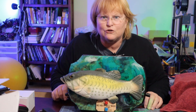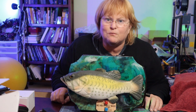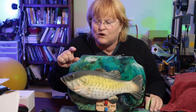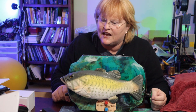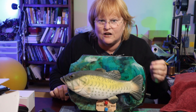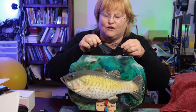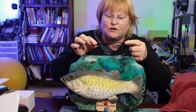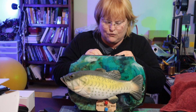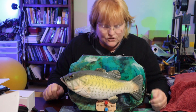I had a little trouble with power management. I tried to solder power to the pads on the back of the Raspberry Pi Zero W and ruined a Pi or two doing that. You're probably thinking, hey, what about those pogo pins you love so much? But I didn't want the physical stack to be that high so it would fit in this case. I watched Maker Melissa, who did a very cool video — I'll link to it — using a microcontroller and a Raspberry Pi. I checked out the build for a DC power splitter cable, got some little DC adapters for micro USB, and put one on each one. So I only have one power cable going into them, which simplifies the whole situation.